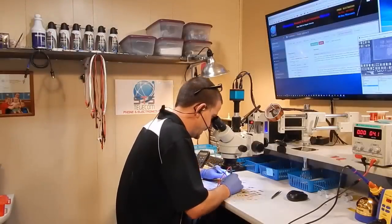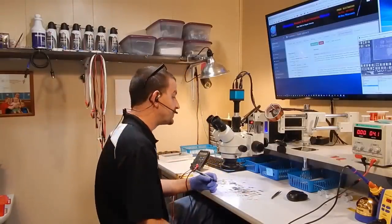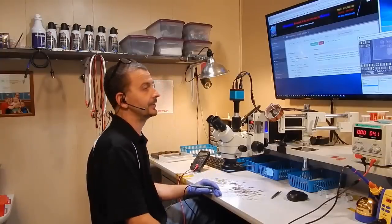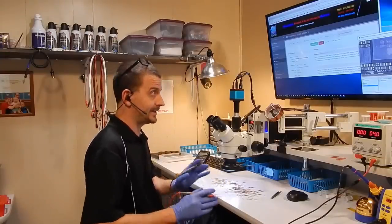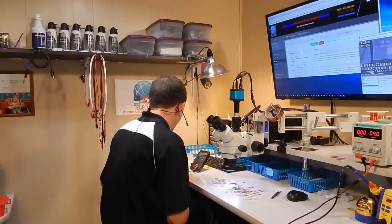I always like checking VCC main for initial testing right alongside the main PMIC. I can get right here — and this is VCC main. VCC main is producing 0 ohms, which means VCC main is shorted to ground. And then you've got the big question: where is VCC main shorted to ground?